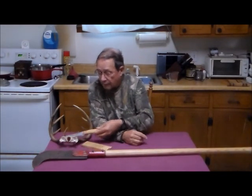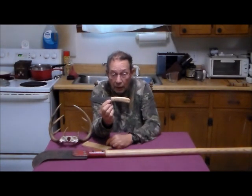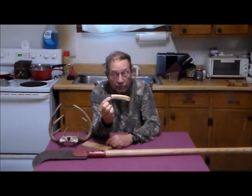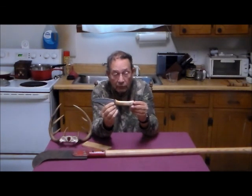Concerning the knife, we're now very nearly through with it. I have two coats of finish on it, and between the coats of finish I'm sanding it down with very fine steel wool. This increases the depth of the finish. When I am completely through with it, I will take it and put a coat of wax on the handle.